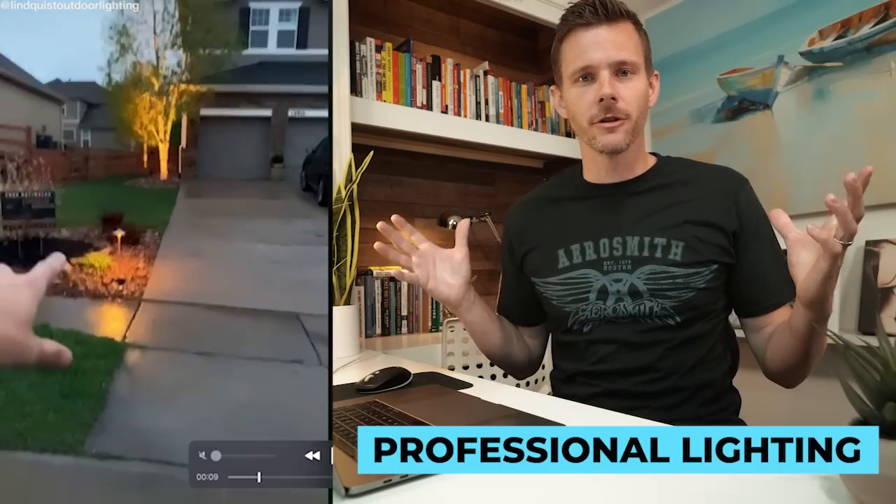Number six: professional lighting is something that makes a huge difference, and it's so cost effective. I wanted to show this video because of the difference it makes with this house — look at the tree lit up, look at the boulders, the lighting on there, and path lights. Every single LED light is between 20 to 40 bucks for the most part. If you get real good quality ones, sometimes up to $70 or $75. You clip these in using 12-2 or 14-2 wire, snap them in, bring them over to a transformer, connect the ground with wire nuts, set the transformer, and boom — this thing instantly transformed the space.